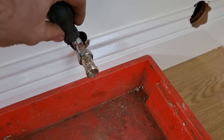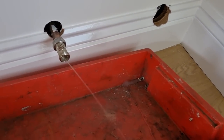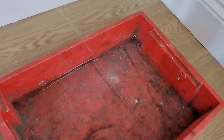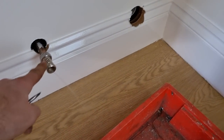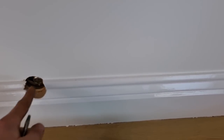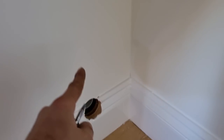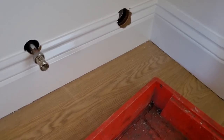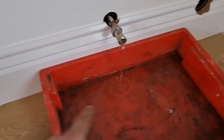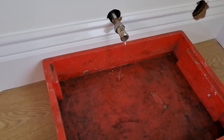I've already opened the cold tap - this is pretty much the lowest point on the system. We'll carefully try not to flood the place, open that up, and just get as much water out as we can before we cut into our pipe so we don't cause a flood. These are going to be the washing machine pipes. I've messed up a little bit here because I haven't quite brought my pipes through far enough. I might just have to trim this out a little bit and extend these, then bring them up - double check valves into my washing machine valve. I'll put a hockey stick up there somewhere, but I'll do that once I've got the shortstop done.